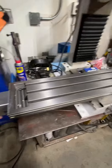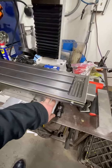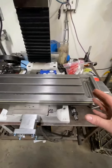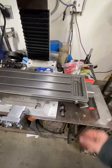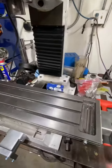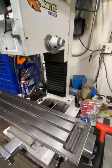The X-axis felt a little chunky when I went to turn it. What I found was I had to loosen up the X-nut and the end cap of that ball screw, and screw the table all the way to the left so they could find their natural zero point, then tighten it back up. Now it's nice and smooth.